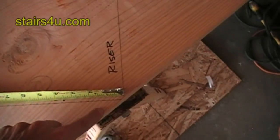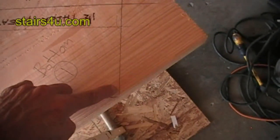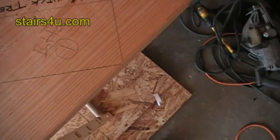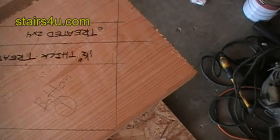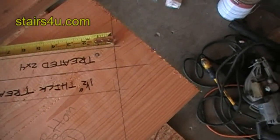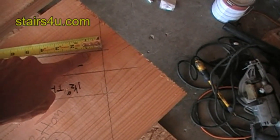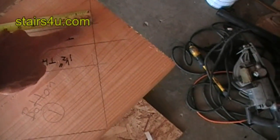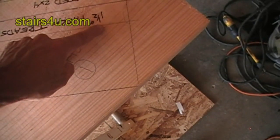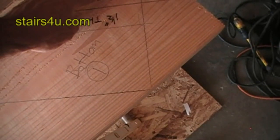I'm going to do that on every riser, including this one here. If you've already got the bottom of your stair stringer cut out at seven and a half inches, don't forget to make your one-inch mark there and draw your line from the one inch back to the front. Don't use those lines to go back an inch — otherwise you're going to have a big problem. If you mark from here to an inch here and draw a line, you can see how far back you would be.